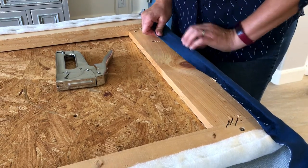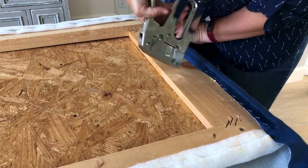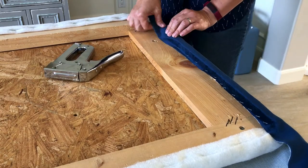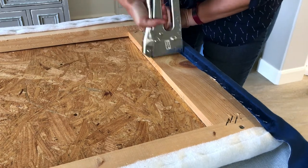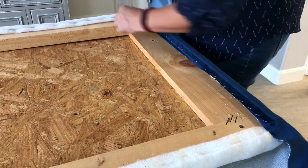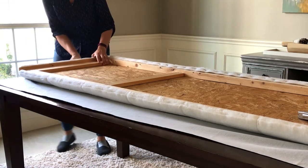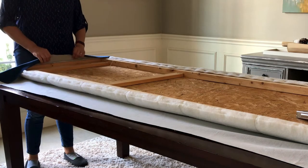I don't staple the corners at all initially — I leave them staple-free for about four or five inches up each side and do those last after all four sides are stapled. I'm using a heavy-duty stapler meant for projects like this, though it is a cheaper option and harder on your hand. More expensive options are available that will be easier on your hand — I'll link to some of those in the description. After finishing that one short side, I moved to the exact opposite side and pulled the fabric nice and tight before stapling.